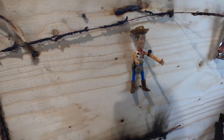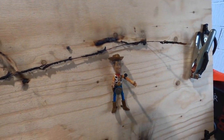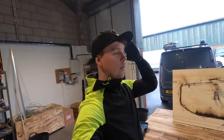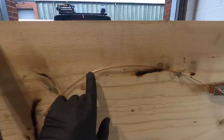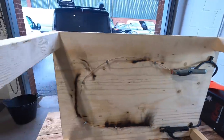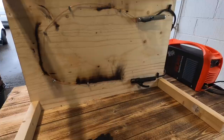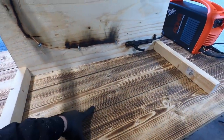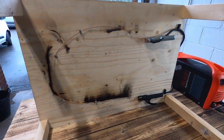I'm going to do the experiment upside down — we'll put Woody on the surface and do exactly the same thing to see what actually happens in a suspended ceiling. In offices with suspended ceilings, you have a lot of cables run across the top. If they're suspended, most of the time it's a very thin ceiling which can come down. So I've done the same thing: PVC clip, PVC clip, PVC clip, metal, metal, metal. I'll put legs on the stand, flip it on its top replicating a ceiling, put Woody below, and see which cable drops first.